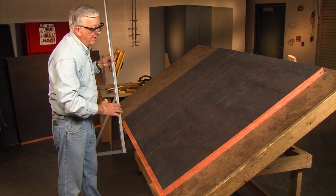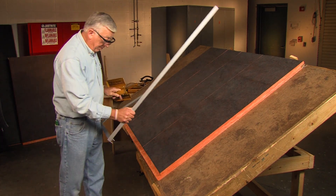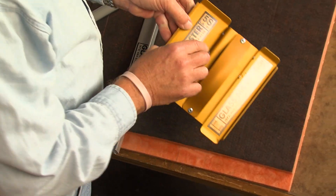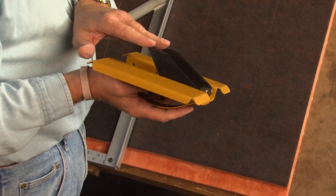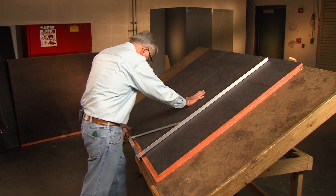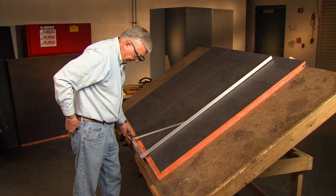So we've made our first three panels. Our fourth panel will end up forming the stapling flap, and we use a number 5S tool. This tool cuts the insulation and does quite a bit of cleaning of the stapling flap, but we'll want to address that when we get finished. I'm going to pull the board up — we were at 12, 8, 12, and I want to be 8 this time. Again, from the right-hand groove.